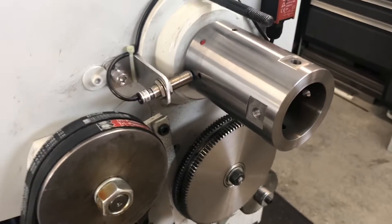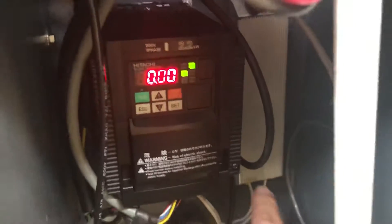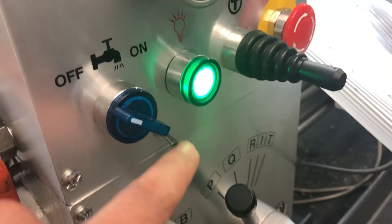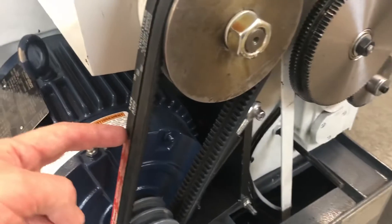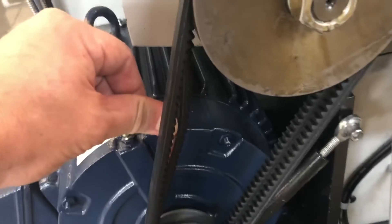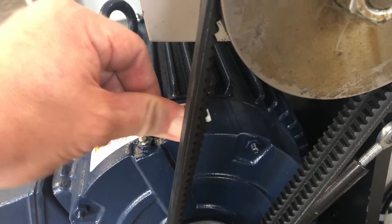If you're wondering how fast it stops, it's a 1-second stop time. I have a braking resistor mounted onto the VFD which allows that. I also have a flip switch right here that lets you choose between 1 and 3 second stopping time. The belt tension, per Gates' recommendation — I actually measured it — is exactly a half-inch deflection in the middle on each belt.